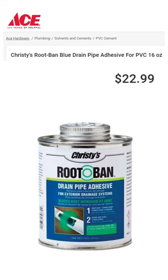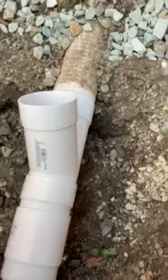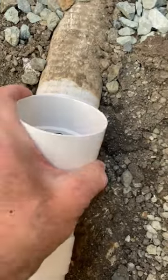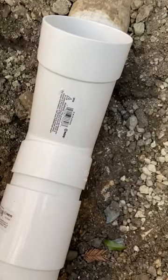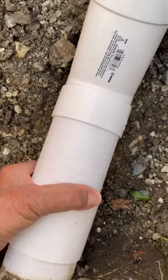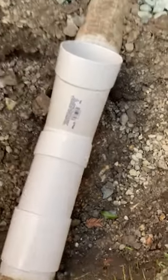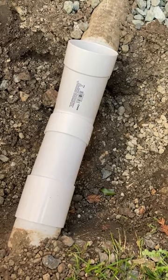Note the price: $22.99. A few weeks ago, I decided to add a clean-out to a French drain I installed about eight years ago using triple wall pipe. In this photo, you can see I've already cut the triple wall pipe where the PVC fittings will be installed to make the clean-out. I'm doing a dry fit — I got the coupling and the clean-out fit in, and the pipes joined together, and then I'd be able to slide the coupling over it. So I've proved that this will work. Now I can put some adhesive on it and glue it together.